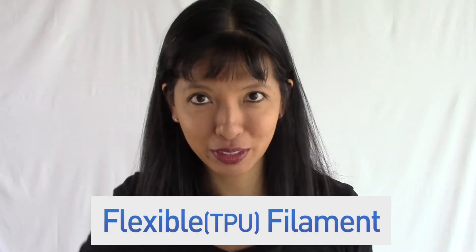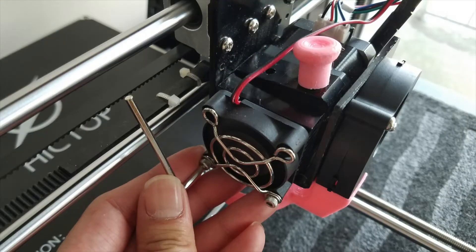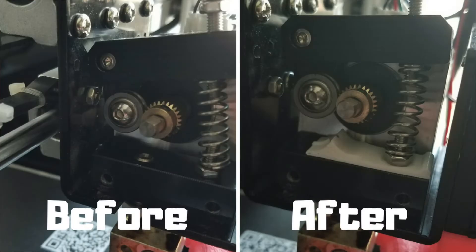Then I started looking at printing in flexible filament. It is not easy to print in flexible filament. First of all, I had to modify my printer ever so slightly so that the flexible filament would thread into the printer. Secondly, I had to print at half the speed. The original thing that didn't work took me about four or five hours to print at regular speed, so then I had to print at half the speed, meaning this took about nine hours to print — not to mention it took me a couple of tries to get all the settings right. Total print time, if I had gotten it right the first time, was over nine hours to print this case.